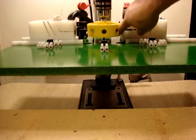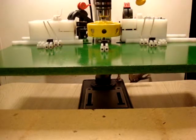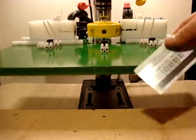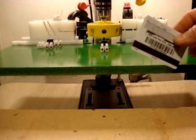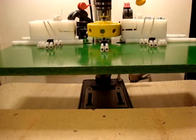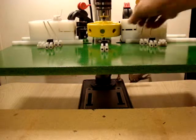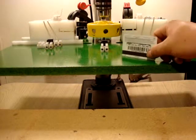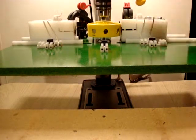How did I gauge our distance from the rotor? It was gauged with an old shopping cart token — I'm sure everybody's got a few of those laying around. That's the distance we've set in our rotor — about 1/32 of an inch — and that's a good gauge so everyone can see where we're at.